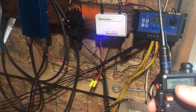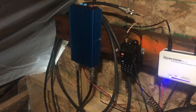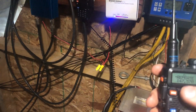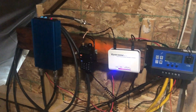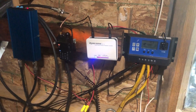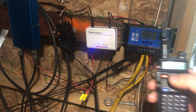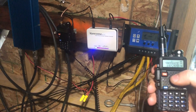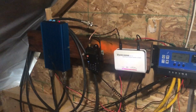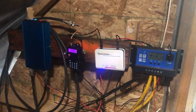The way a repeater is set up: this unit is transmitting on one frequency and receiving on another, and the radio on the other end is receiving on that frequency and transmitting on another. So I'm not going to hear both transmissions — I'll hear my own transmission but she's not going to hear both. As long as I'm not in direct radio-to-radio range, I'll only hear one transmission. Even though these are transmitting at four watts, once this receives it, it goes back out at 85 watts.